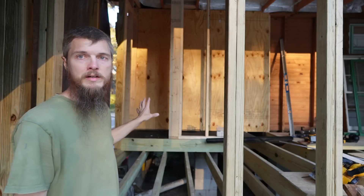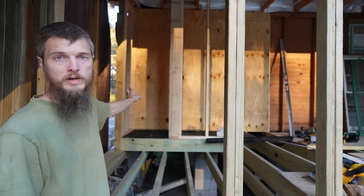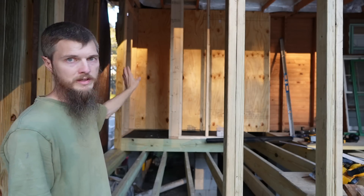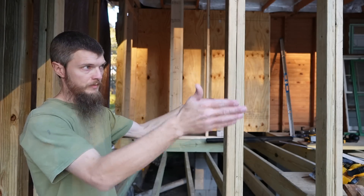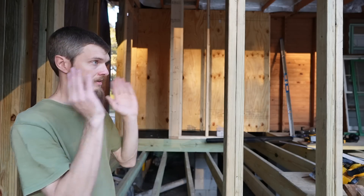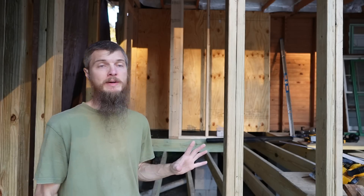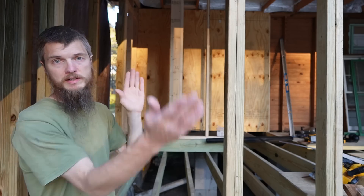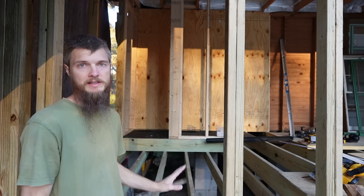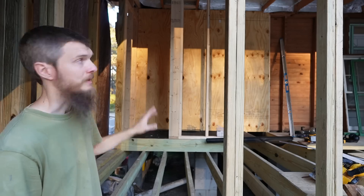That's why we decided to put them out here. So that closet opening is where the water heater is going to be — we're going to put a door there, water heater closet. Over here behind that wall is the washing machine facing toward the living space. This space is fully framed out now. I don't think I have to do any more framing except for replacing more studs in that wall, straightening them up and lining them up on 16 inch centers. As far as wall framing, it's pretty much done.